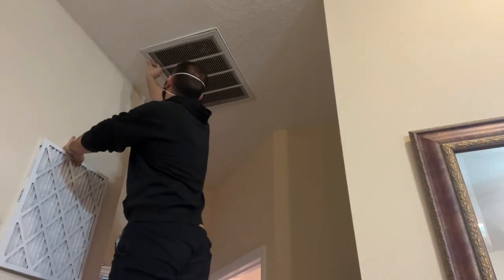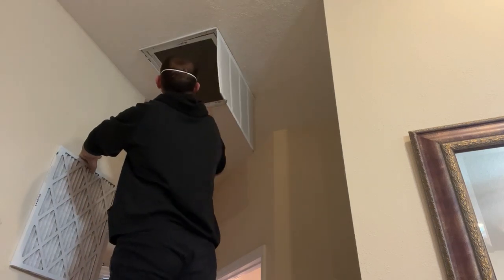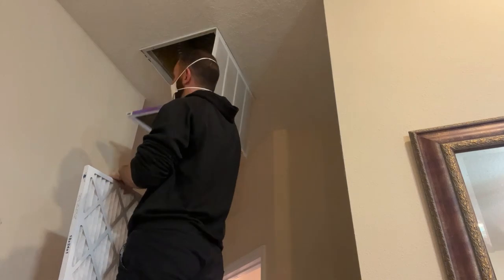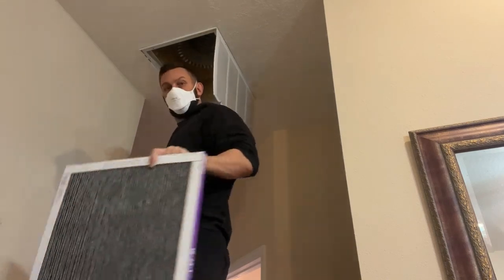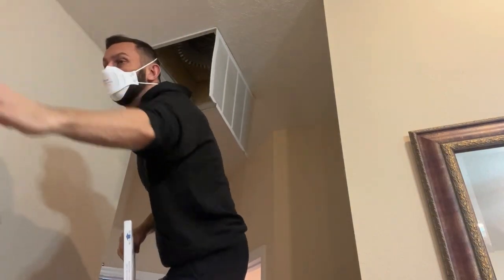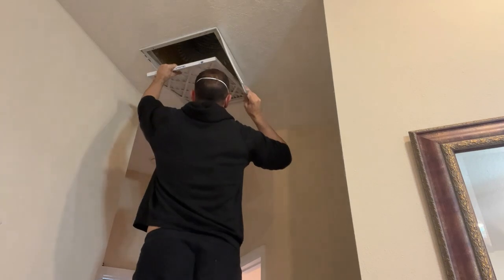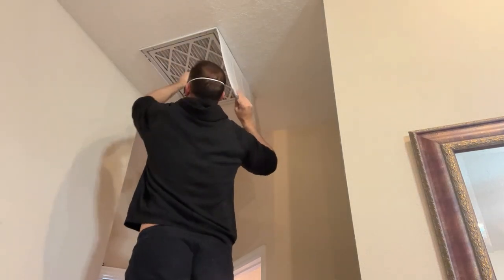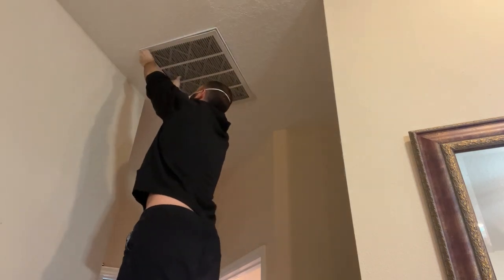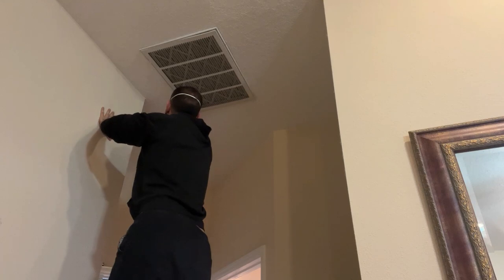If you're looking to get rid of dangerous particles out of the air, you can also pick out those MERV 13 air filters. If you're looking to really clean your air — get rid of pet allergies, dander, and whatever may be going through your air getting you sick — these are fantastic. High filtration but also low pressure drop for airflow resistance, so it's not going to be overworking your air system.